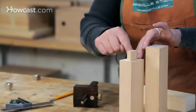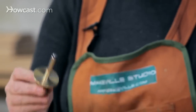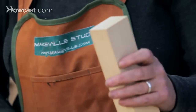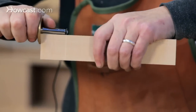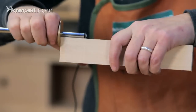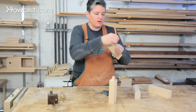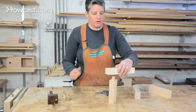This is a wheel marking gauge, similar to the mortising gauge. It also has a reference face, but instead of pins it has a sharp-edged wheel that scribes a line. It locks into place with a brass knob. To use it, press in on the black wheel, press forward with the brass face, and drag it towards you. I now have a shoulder line all the way around. A tool like this eliminates the cumulative error you'd get trying to carry a pencil mark around all four faces.